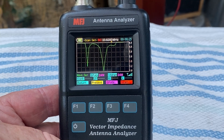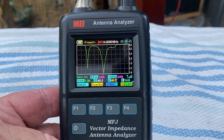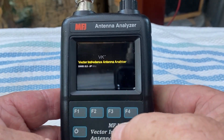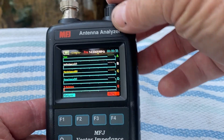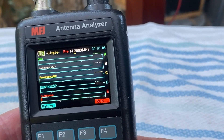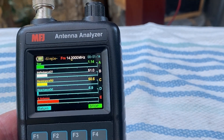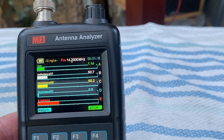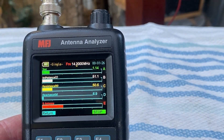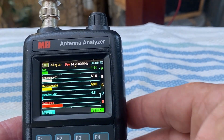As we climb up towards 15 meters it goes off. I haven't tried to really check it for resonance on 10 meters — all I wanted to do was get it resonant on 7 MHz and 14 MHz, that's 40 meters and 20 meters. Currently set at 14 MHz — at 14.200 MHz the SWR is virtually 1:1 and the impedance is virtually 50 ohms, which is incredible considering what I've just done and what wire I've used — 3.2 mm thick stainless steel, not copper or anything like that, just normal guy wire.